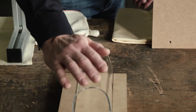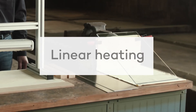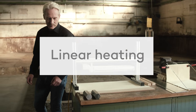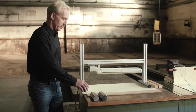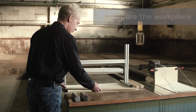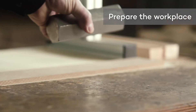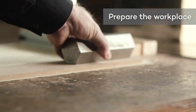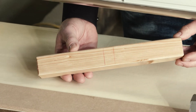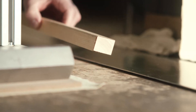For linear heating, only part of the sheet is heated. The basic setup is the same as for surface heating. An additional stop bar ensures that the sheet is always heated in the same place, even when it is turned. Hold this in place using weights. In addition, place two wooden spacers on the cotton fabric and two covering plates on top of them.